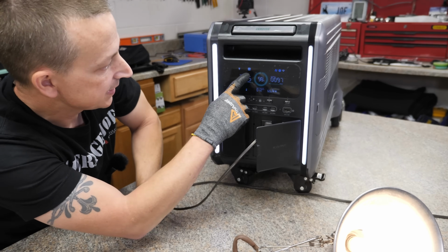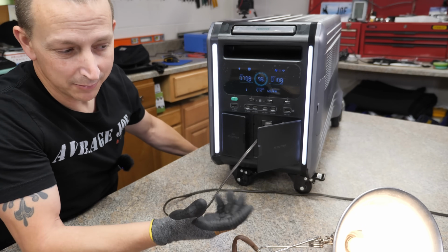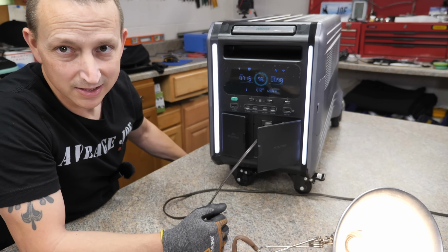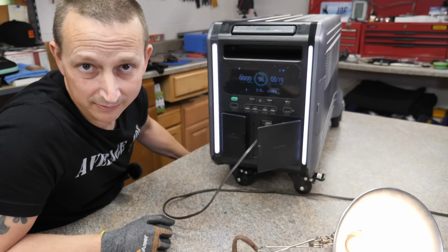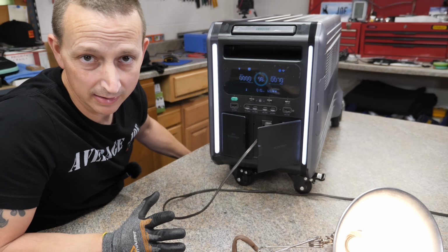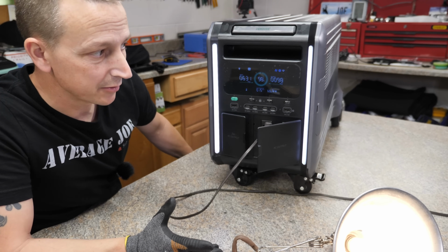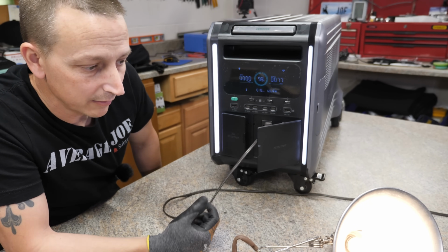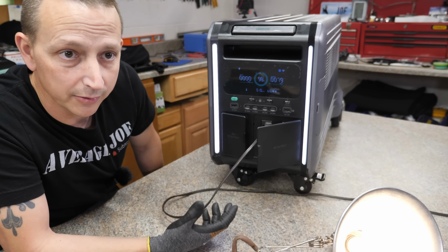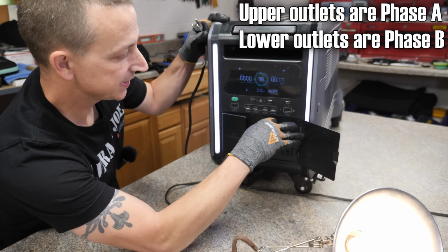Plug her in. You can see UPS mode showed right up here on the top. I'm going to go ahead and unplug it. Maybe we'll see a flicker. Barely. We'll go ahead and plug it in one more time. Maybe you're having some really bad brownouts. Plug it back in, flips back over into pass-through mode and charging mode. We'll unplug it again, and we just have that little tiny flicker. So UPS function works just fine, and that should work for every single port.